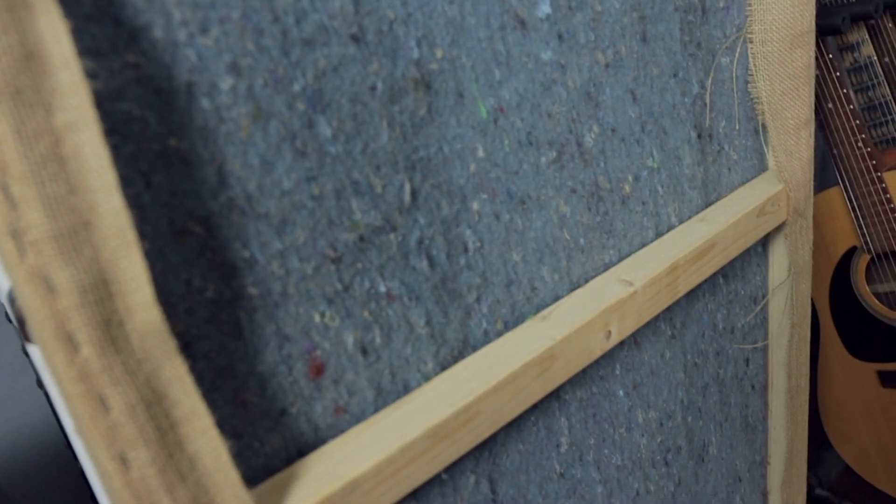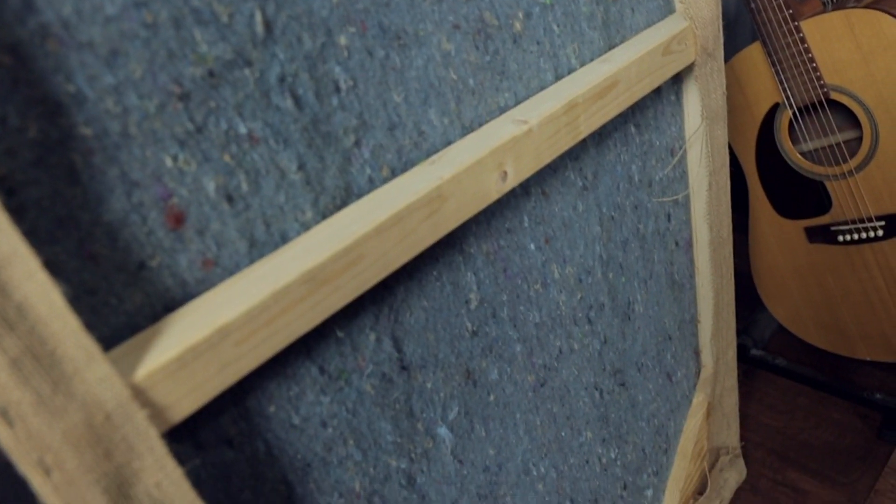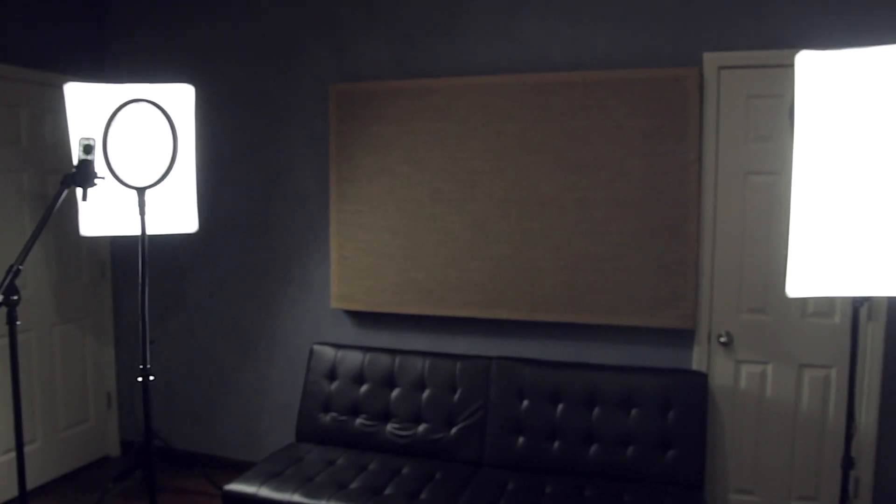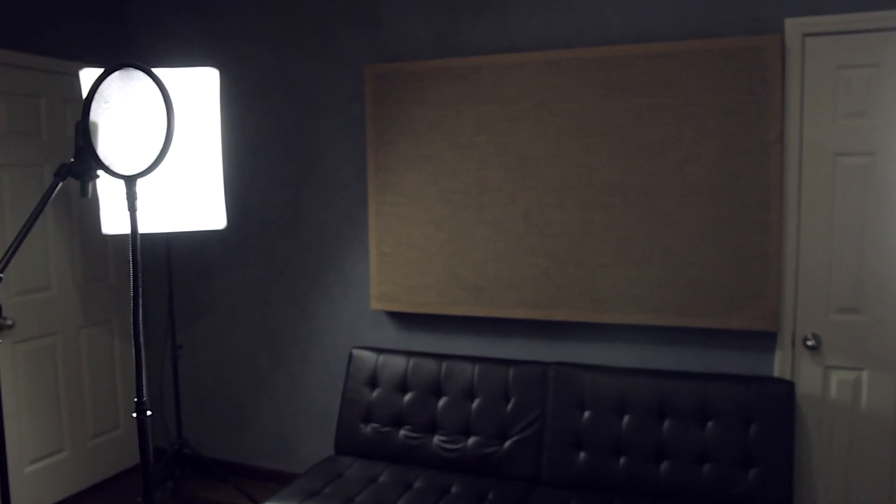Let me quickly show you what I have set up so you can get a feel of what I'm working with. As you can see, I have my acoustic panels on the walls — I actually have seven of them. They're just a one-by-four frame of cheap wood from Home Depot, a two-inch thick recycled cotton acoustic panel on the inside with a two-inch air gap behind them, and then just jute burlap from the fabric store wrapping around. Nothing too fancy. Those are two-foot by four-foot versions. I also have a larger panel in the back that I had built for the other space, and I'm just using what I have currently.